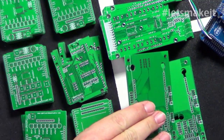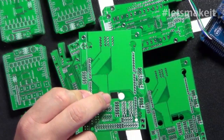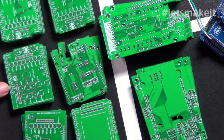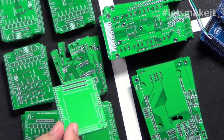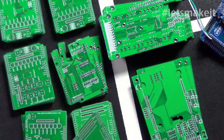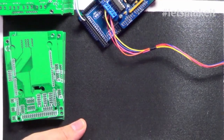It's a breakout shield for monitoring tally lights, a general GPIO shield. This shield is actually bigger than a Mega - the Mega fits inside this shield, and on top through this hole is an Ethernet shield. It's a jumper board to go to all the boards for the switcher. And I have some development test boards for different types of I2C chips, plus a dev board which holds a breadboard and pins to go from the Arduino.